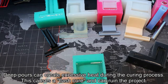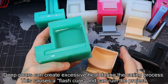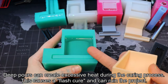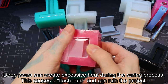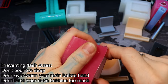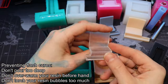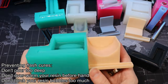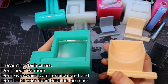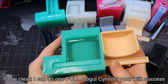When pouring, also be aware of deep pours. This big mortise cylinder here — if this is the deepest I go for pouring just craft resin, if you go any deeper and bigger than this you might need to look for what's called a deep pour resin. The reason is when they get deep like this, even as deep as an American lock display, they can get really warm — that's part of the curing process. This size works really well. It's when it gets to about the size of the mortise or mogul cylinder that you might need to do multiple pours or get a deep pour resin.